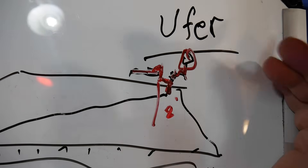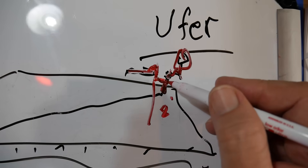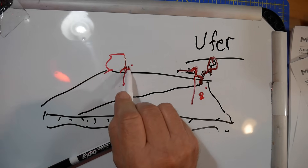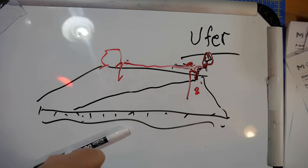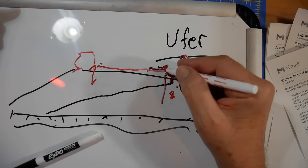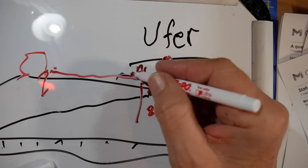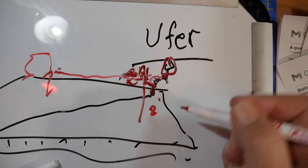If you've got a panel in there, you want to bring this down as close to the floor as you can get it, and then these two are bonded. I would not recommend using a safety ground as your station ground. Put this a couple, three, four, five feet away — or if you're over in that corner, put your ground in there and then bond over to the UFER. Where you ground outside, that's also where your lightning arresters go. You've got that big cable attaching your inside station ground to the system ground.